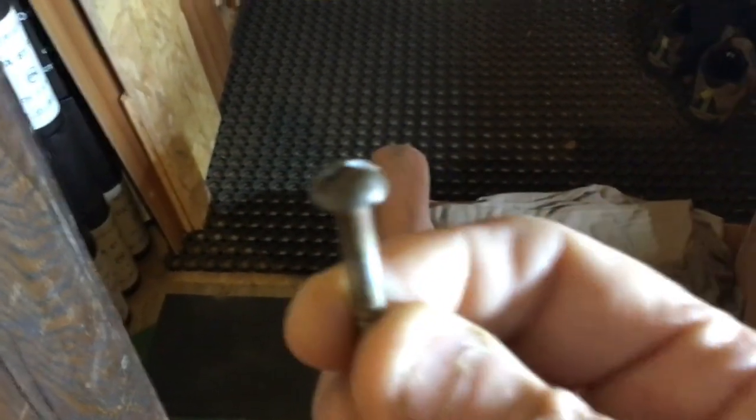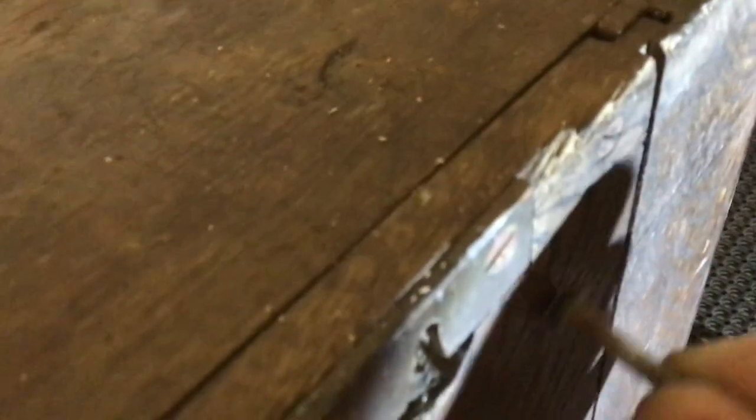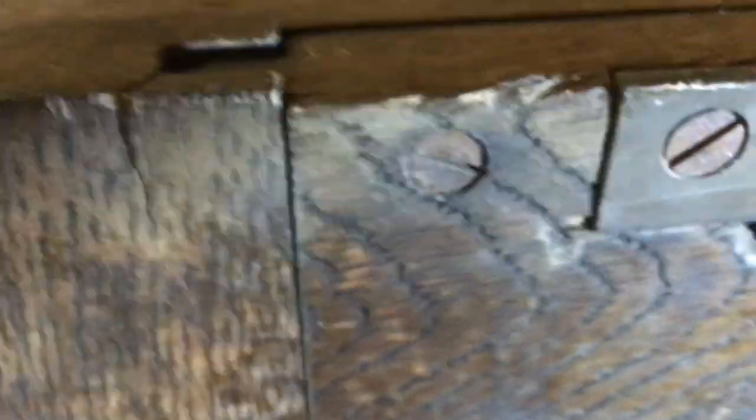So we take a round-headed screw, not brass, steel, iron, whatever it's called, with a head. With a size that will just, I'm trying to do this one-handed, it's good fun, just fit in that shank. Another important thing at this stage, I'm just going to turn this light round a bit, or the clock, is to ensure that this has a wideish head. You need to make sure that you can pull this down at least 4 millimeters without it slipping out. This will be important for later.